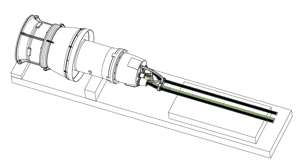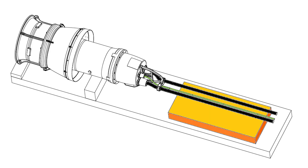Position the pump in a horizontal position with the cables in a parallel line away from the motor top. Support the cables so they will be at the same level as from the motor top, for instance using a pallet. Mount the wire rope onto the lifting bracket and place it in line with the cables in a way that makes it easy to install the cable clamps onto the cables and the wire rope.